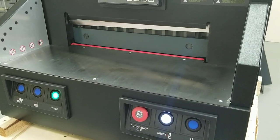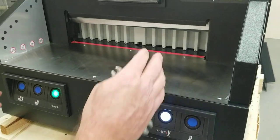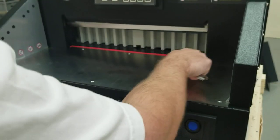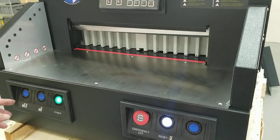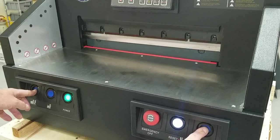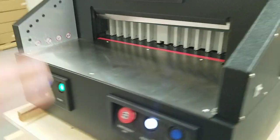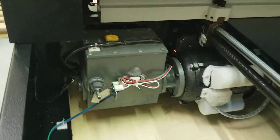See — it went too far. If the tab is way off, the blade won't stop when it's supposed to. It will go all the way around and come back up a little bit, stop, then reverse itself and go back the other way because the tab is too far out of position. It's allowing the blade to go in a full circle — going too far all the way back up.